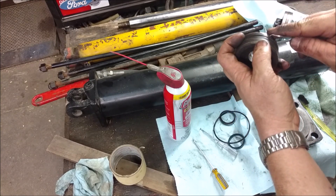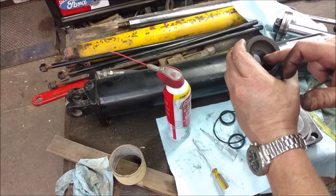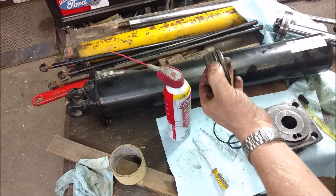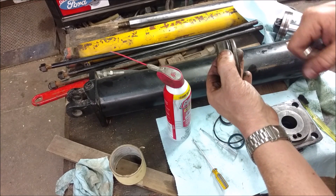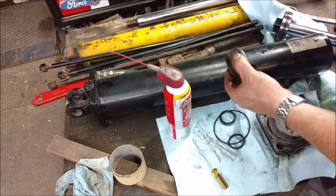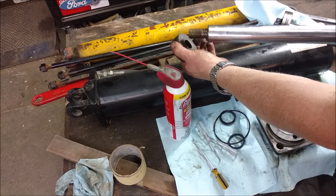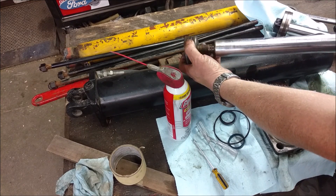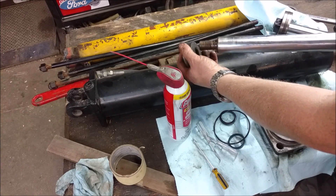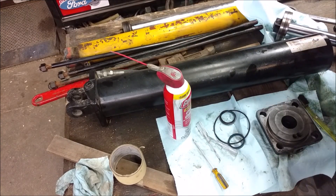What happened to this cylinder, if you're wondering: somebody didn't get the nut on the bottom torqued, so the nut fell off, the piston fell off on the inside, and the rod went around and just flopped around. It came completely off and was just flopping in there, scratching the crap out of everything. And because the piston came off there was no pressure, but it just banged everything up. So I had to get a new one.